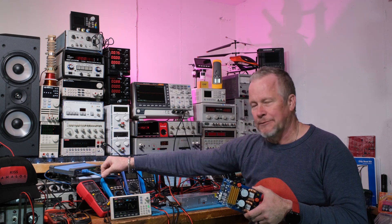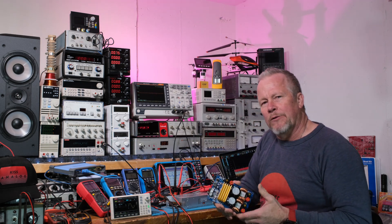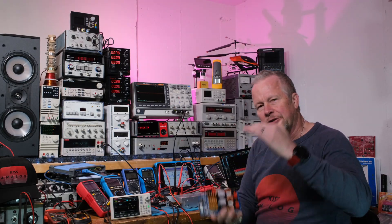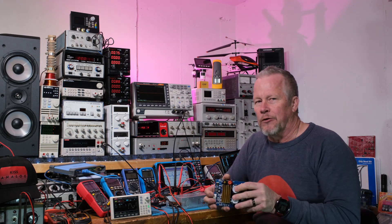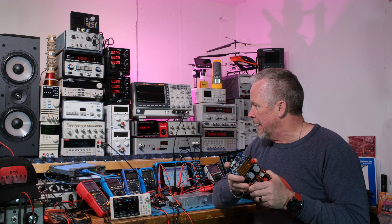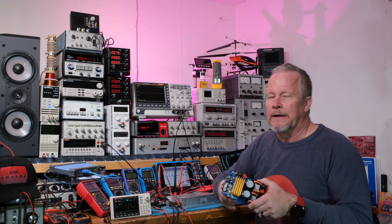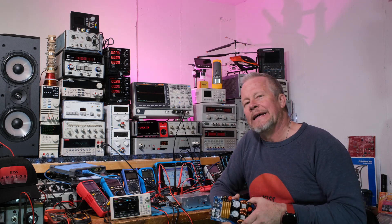One of the changes I've made is I'm using my Picoscope 4444, the differential input scope. I'm using one channel and looking at the output. This scope has 12-bit resolution, which is really cool and gives great resolution so you should see the noise really well. I'm going to change the sampling rate so we get a good sampling out to 20 kilohertz - just the audio band. We'll start off with the linear power supply and then power it up with the switcher.